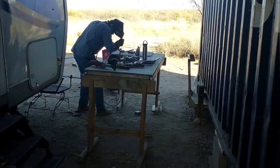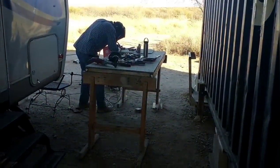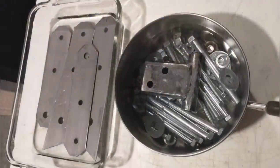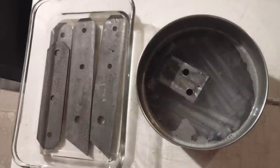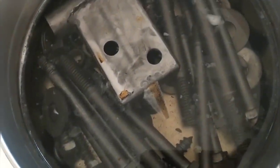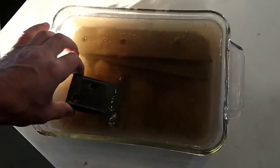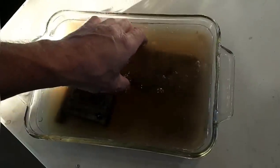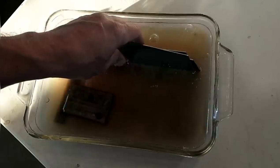Here I am welding them together. I'm not the best welder, but I can definitely stick it together. I'm going to be grinding it all down before I finish it anyway. With everything fabbed, I'm ready to submerse everything in a couple baths of vinegar. This will remove the scale from the strap metal that I used in the piece that I fabricated, and it'll remove the nickel from the bolts, washers, and nuts. This will need to soak for about 24 to 36 hours, but it should completely remove everything, and by the time I'm done I'll have a nice uniform color and look on all the metal pieces instead of having shiny bolts and dark scaly metal.